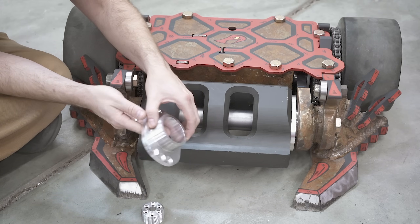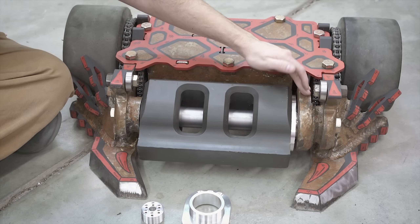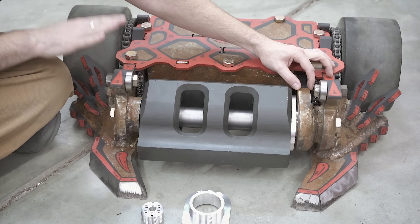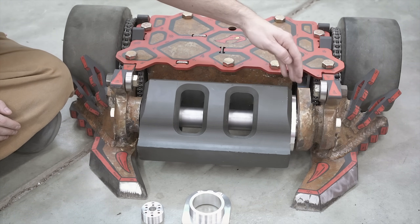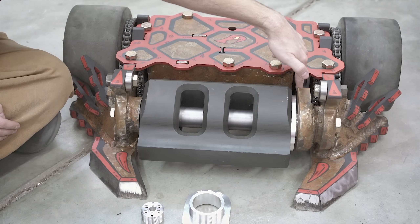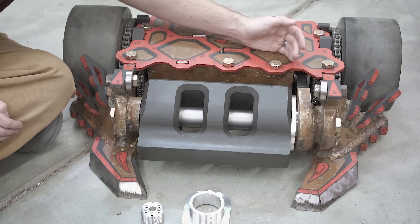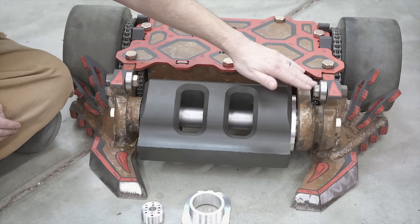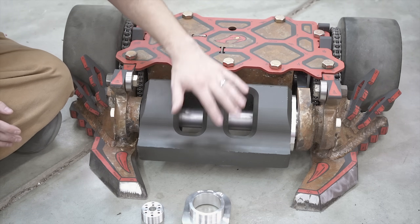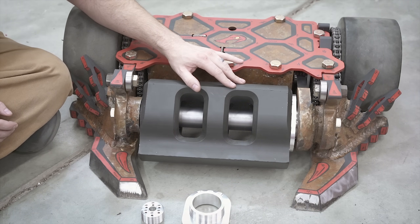Because of this new profile, which is a lot more susceptible to damage, we had to end up adding a belt guard. Belt guards are just generally a good idea. This is made out of the exact same material as the frame — actually cut from the exact same piece — and this belt guard wraps completely around the whole pulley, with maybe only about a 1.5 or 2-inch gap where the belt is visible, but this is fully protected. So the drum will spin about the same speed, maybe a few percent faster on the top end, but it will get up to speed a lot quicker, and partially that is thanks to HFI.